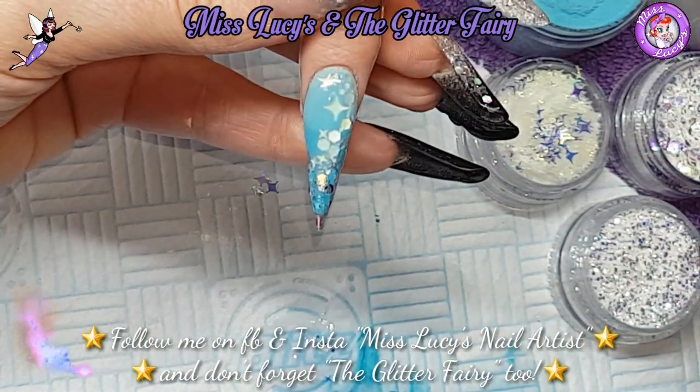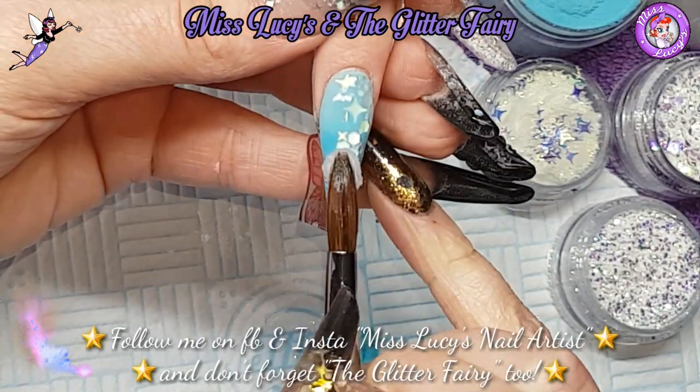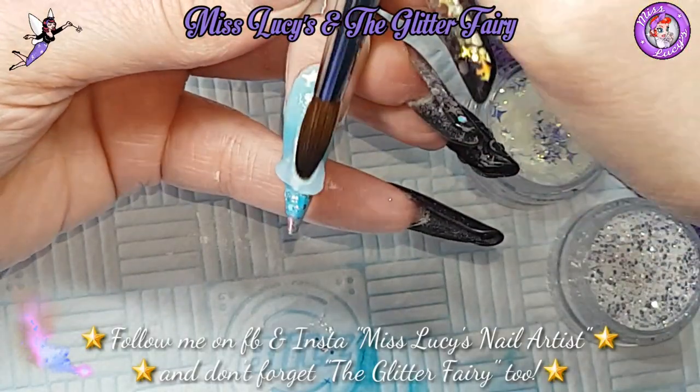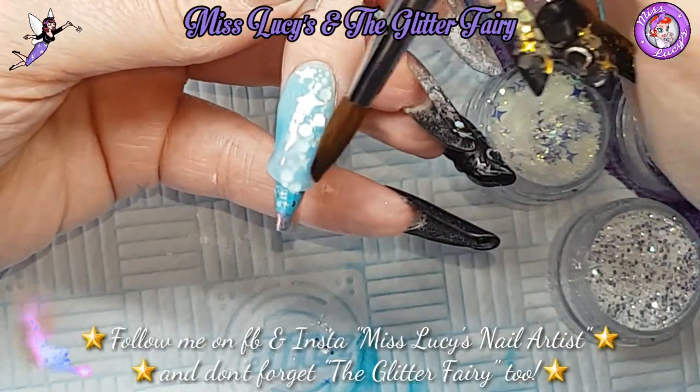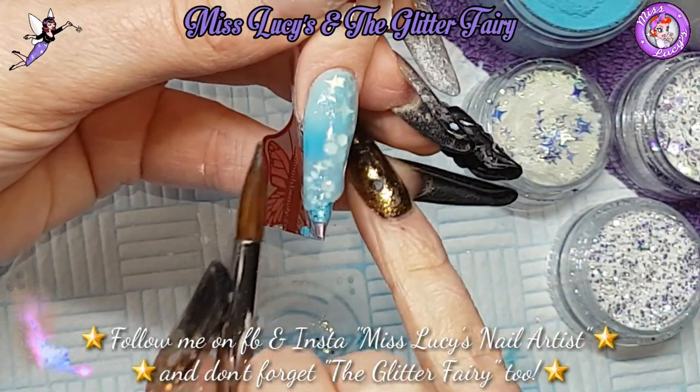I'm doing this in more than one bead, so I make sure that before I come onto the next bead I've blended down that first bead so you don't get a big ridge. Then slightly overlapping my second bead - first blending back and then pulling forward to create that shape.